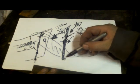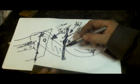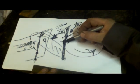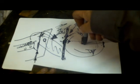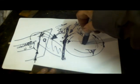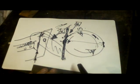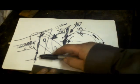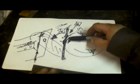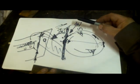Let it cut with the edges, let it cut fast, let it cut free, and don't put it too far through the metal, and it will literally only have that much contact, less heat in the steel, and your motor's spinning more free. Because these little angle grinders, if you give them a hard life, you'll probably kill one in about 20 hours. But if you let it get up to speed and just go through at high speed, less strain, you'll get far more life out of your grinder, far more life out of your disc, because you're only going through a little bit, and you're putting less heat into the steel, because you're not putting action on the side of the disc by blasting the disc too far through and out the other side of the steel as you're cutting it.